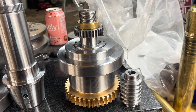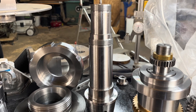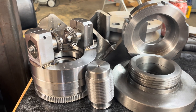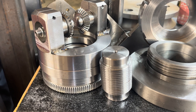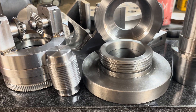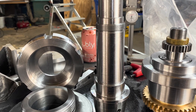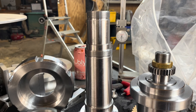This is almost all the major rotating components. That's the output shaft and worm, the main shaft with the L00 tapered collar and locking ring, the differential carrier, and the lead compensation worm gear and worm. I've got a few minor rotating components to make — the smaller shafts and bearing supports — and I have to make the large bearing support that mounts the main shaft, but this is most of the hard stuff done.